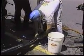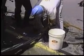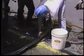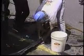Let's first look at the application of Polywater J in the field. J is a thick gel designed for hand application, pumping, or front end pack pre-lubrication. J can be hand applied to cables as they enter the conduit, or cables can be re-lubed as they pass through intermediate vaults on long runs. It's important to coat the cables completely and evenly as they enter the conduit. The thick Polywater J gel lube is also best for vertical up runs, minimizing dripping and flow back of lubricant during the pull. Gels are also best for any kind of overhead application of lubricant.